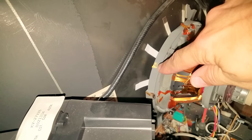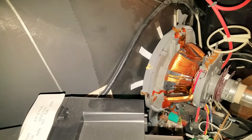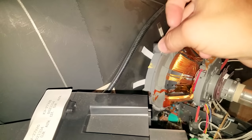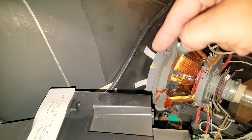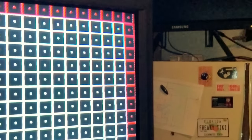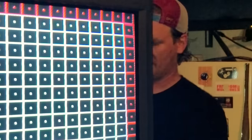On the back of the tube, do you see this? I'm not touching it - this is where the magnet was. It was actually on the yoke assembly and I noticed it had just moved a little bit, and as I wiggled it around it actually got better. So I'm going to put my gloves back on before I get too close, then reseat this magnet along the gray part of the yoke and move it around so you can see the convergence as well as the geometry change.